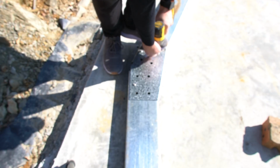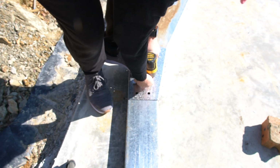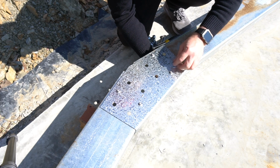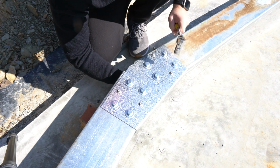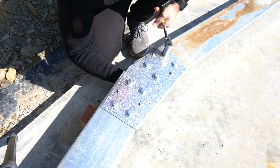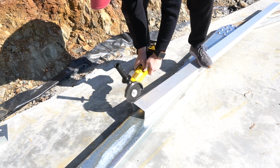Start by Tek screwing the apex bracket, which holds it together so you can add bolts. I ended up lifting the trusses onto their edges to make assembly easier. Engineering plans aren't step-by-step instructions, so patience and attention to detail are essential. If you're confused, examine the plans and bill of materials closely. For instance, this kit has 4 trusses with a double truss in the middle, and I didn't notice straight away that the middle 2 trusses install back to back. Next, I attach a cross brace to the centre, finishing the trusses for now.